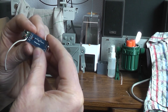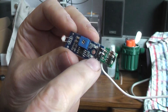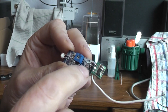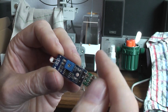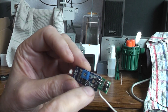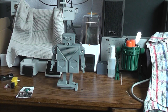There are a lot of different sellers for this particular board. You can identify it just by looking at it. I've noticed there are ones that have a four-pin header and ones that just have a three-pin header on the back — the rest of the board looks identical. The difference is the ones with four pins also have an analog out. This pin sticking up is the digital, which means it either goes high or low depending on whether the photo sensor sees something. The analog ones give you a varying voltage before the comparator, and there are indicator LEDs — one that shows it's receiving power and one that shows whenever it's detected light, which makes it easy to set the trim pot.